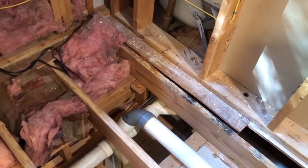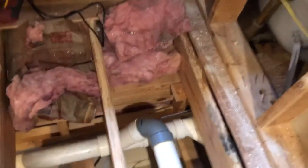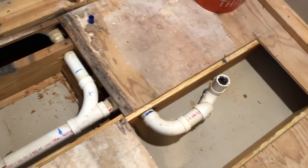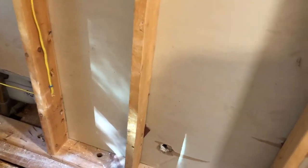One thing to keep in mind - all these vents go straight up to the roof, so if it's going to rain or is actively raining when you're doing this, you can have water coming out of your drain lines. Make sure there's no rain in the forecast for the day or next couple days depending on how long this will take. Be sure to have plenty of little pans underneath these lines to catch water - you don't want sewer water running down on your ceiling. You'll also want to block off the sinks and toilet in other bathrooms so nobody flushes or pours anything down the drain, because that'll just make a big mess.